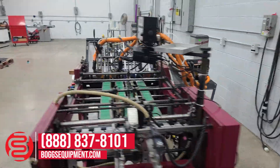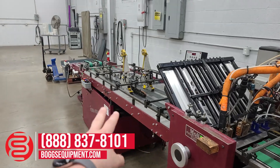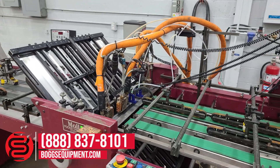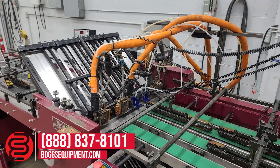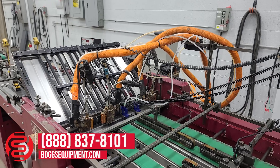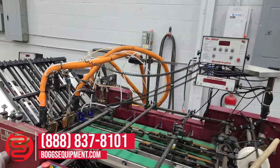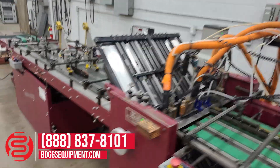The second glue system — and I have them all mounted here, though you can mount them on the Versa Fold or anywhere on the system — is the hot glue system. It's a Glue Bind four-channel hot gluer. It has three heads and three hoses with it; you can add an additional head if you like. The gluer is set up for it. Those are again run by the Quadruplex controller over here. So there are two glue systems: hot and cold.